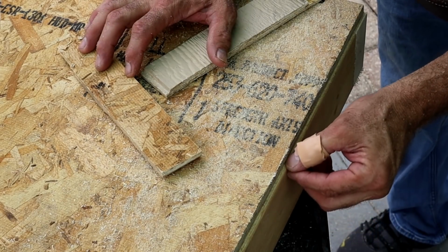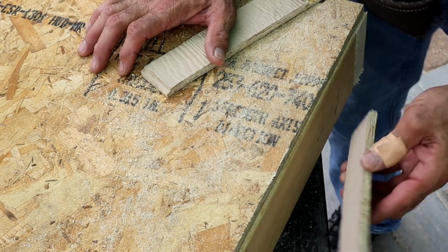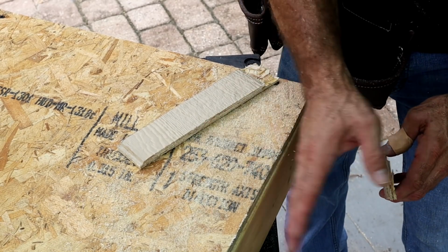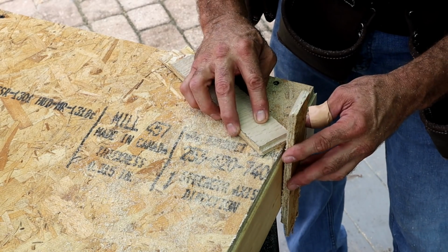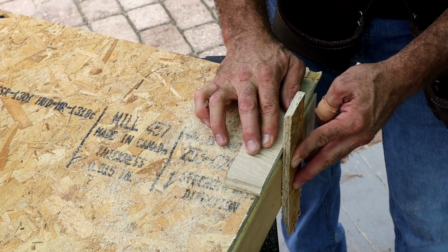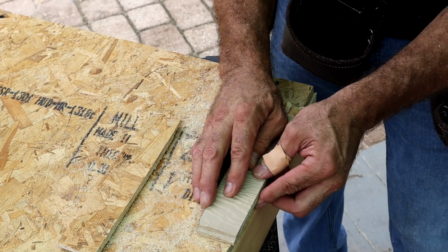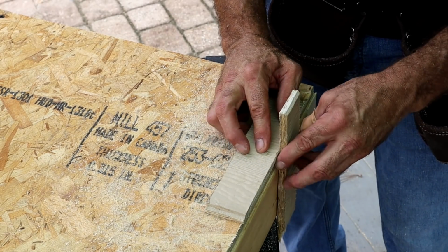You see how I'm just on the inside? This is about a little more, it's about 3/16 of an inch, okay? But that's fine. Even a 1/4 inch would be fine. You just want to be on the inside of this. You don't want to protrude past it, because if you're out, just say I'm out 1/8 of an inch right here, and I have an 8-foot wall, I'm gonna be a whole inch out at the top. It's gonna kick out. So you want to be right here where it's flush. It can go flush. And when I put my base plate on here for my walls, they're gonna sit right on the edge right here, and my sheathing goes up against there, and that tiny little gap is nothing. You won't even know it's there. Is this starting to make sense?